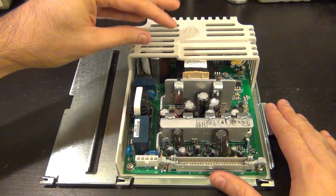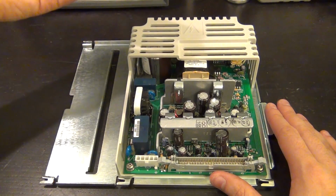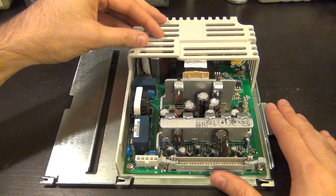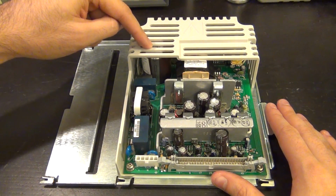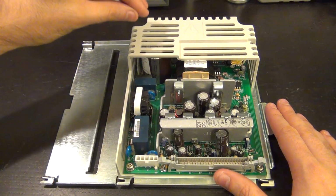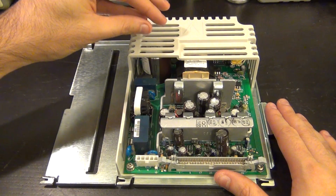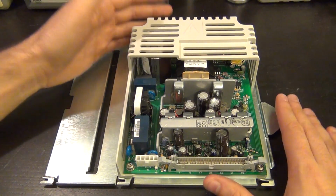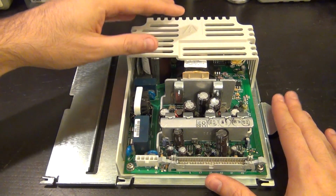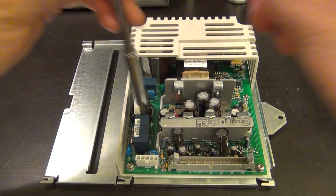Then it will automatically discharge, because there's always some power consumption in the unit because of the soft power on option. So there's always a little bit of leakage current turning on, for example, that 12 volt power supply, which will then discharge this capacitor quickly. But if that part of the circuit isn't working, there's nothing to drain this capacitor unless they have purposely placed a leakage resistor across the capacitor to discharge it, which means that this can actually hold charge for a very long time because it is faulty. So you have to be very, very careful. It's a little subtle point that doesn't always come up, but you have to be careful.